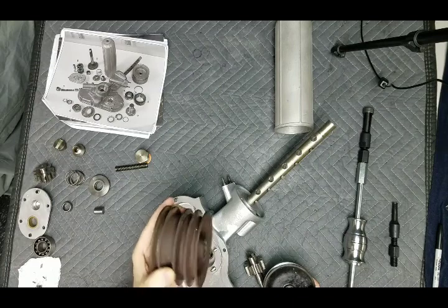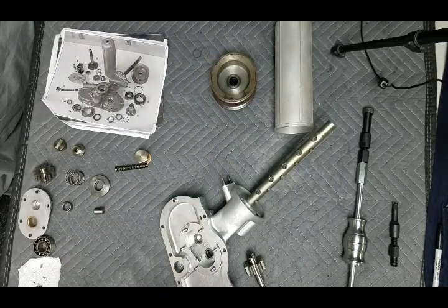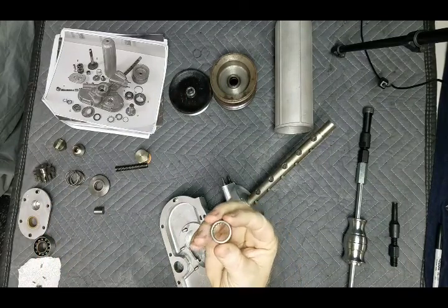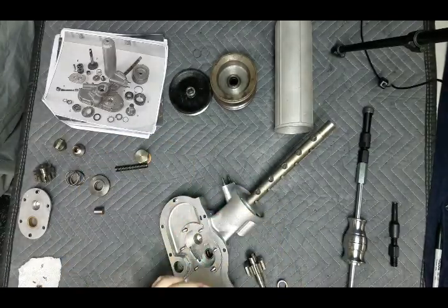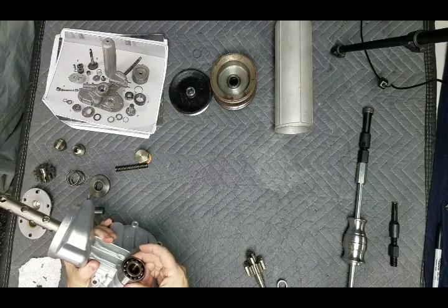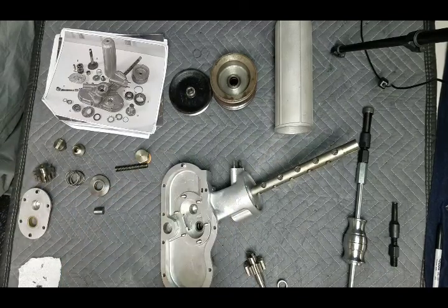With the air conditioner — and it could be a piston type — that puts a lot of shaking into this that has to be absorbed through the bearings. So that's why it goes to a gear drive. Let's look at the actual difference in the bearings. This is a non-air-conditioned bearing, and here's an air-conditioned bearing. You've got a double ball bearing versus this little needle bearing. This is extended out a bit — it's a completely different casting. This bearing sits up here so the shaft comes through and has a lot of support for that pulley. That's why I'm discouraging everyone — don't put on air conditioning, thinking like Vintage Air or something like that. They have some great units, but it's just not designed for it.